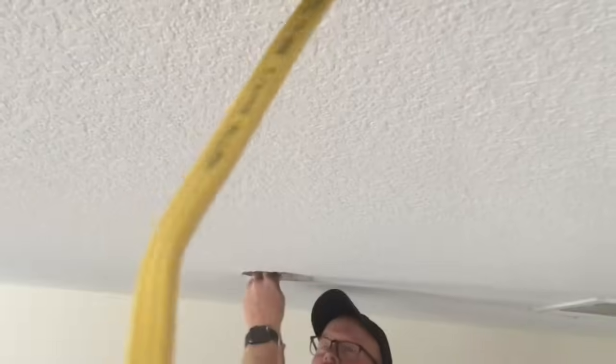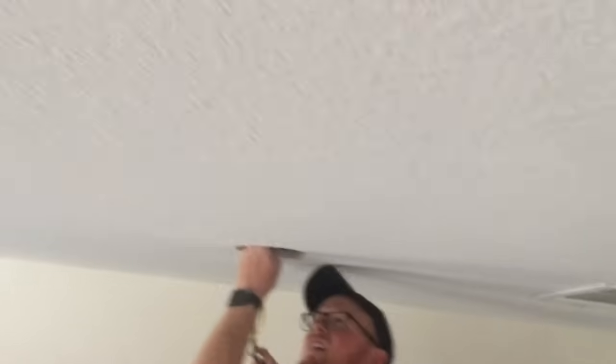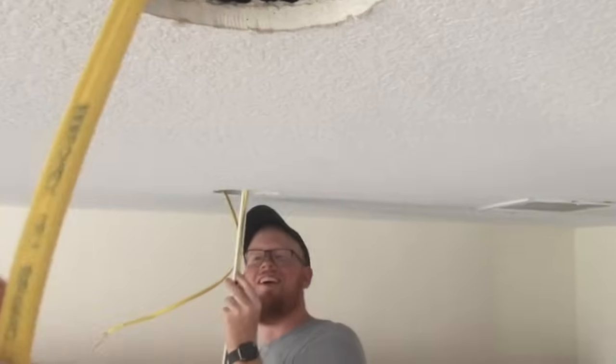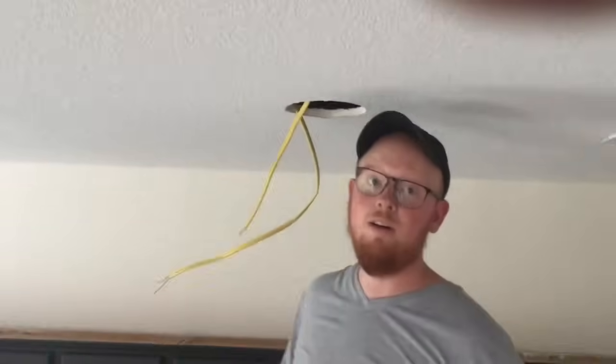When he gets enough in there — Dad, you got it? I got it. Just push it with me. Now we've got a few inches of it into the curtain rod and he's pulling the curtain rod out, and the wire is going in with it. So that's how you get an electrical wire through two trusses or more.